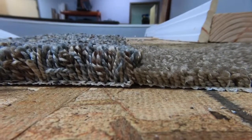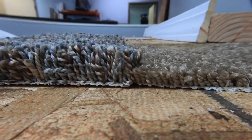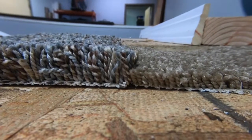The gully spacing is what's going to hold the edge of the trimmed carpet. After we've power stretched it, we've cut it, we tuck the carpet into the gully, and that gully will hold the carpet in place and keep it from coming out with a vacuum or anything like that.